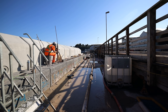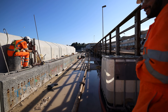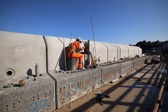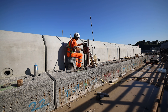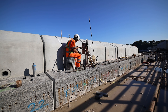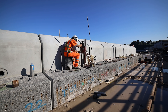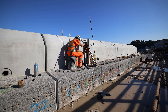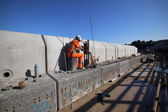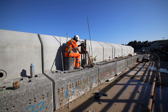The coring operative is coming behind and coring through the recurve unit. We get one of the bars in each of the units first, and then he comes back and cores the other three after — pretty much a shift or two after, depending on whether there are waves. We do have temporary works constraints regarding how many bars have to be cored for the unit to be stable in a certain type of storm, so if needed we focus the drillers in one certain area.